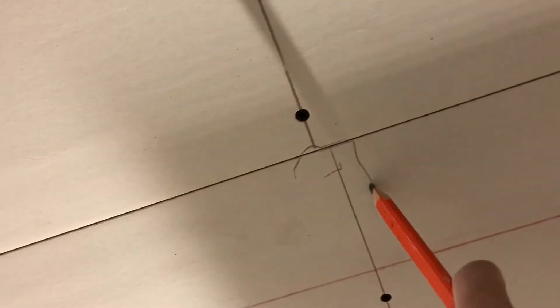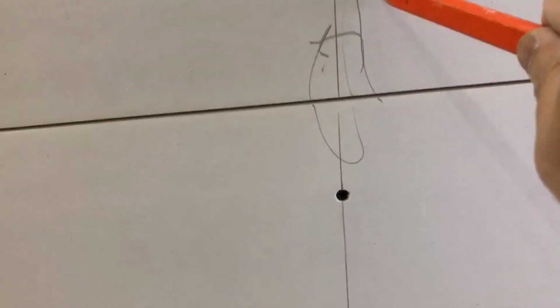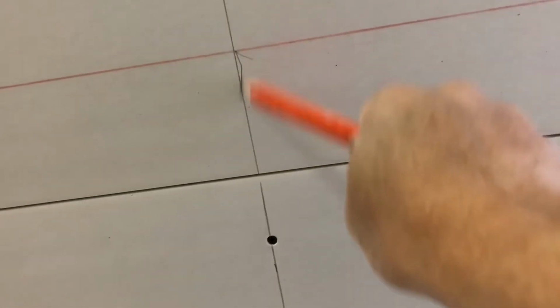Now let's take a look at the ceiling. You see there's no screw on the joint, on this tapeless joint. So I don't know why. There's no screw on the edge of the board. So we have to do something special to make it stronger. There's another joint, same thing, no screws along the joint. So I got to either put some more screws or use some stronger mud.